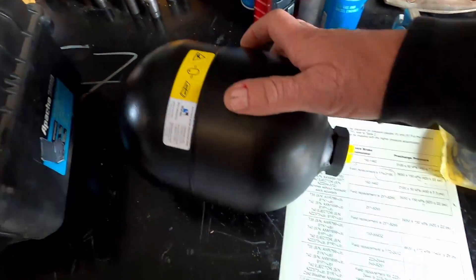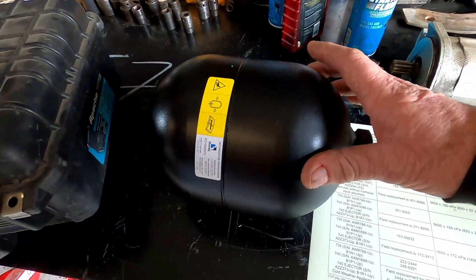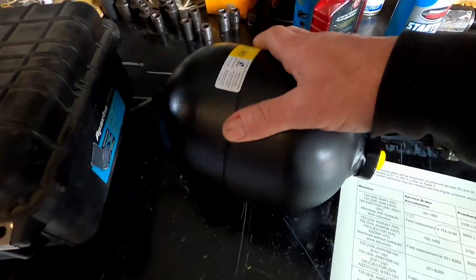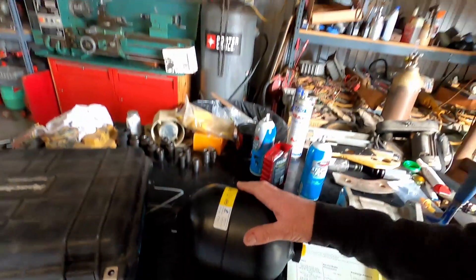A lot of other equipment uses a screw-on capsule type accumulator. These are disposable — when they go bad they're no good, you can't rebuild them. Some of my rock trucks, a couple of my 740s, have the standard type of accumulator that you'd normally see, which looks almost like a hydraulic cylinder. It's got a piston that floats in it with packing inside.